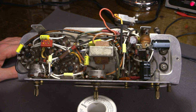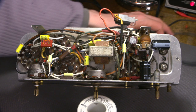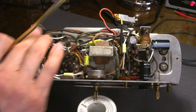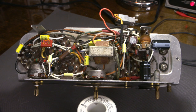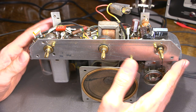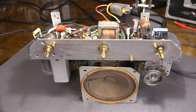I haven't done any alignment on it yet - we'll do the alignment together and hear the difference just from changing the components and getting everything working. I have the radio attached to my isolation transformer and current-limited Variac supply, and also attached to an external antenna. I've also replaced the dial cord - that was a bit of a pain because no matter what I did it was just slipping. I tried fishing line, which this now is, and I tried actual dial cord made by General Cement - it slipped as well. The main tuning capacitor felt like it was moving very free, but obviously not free enough.